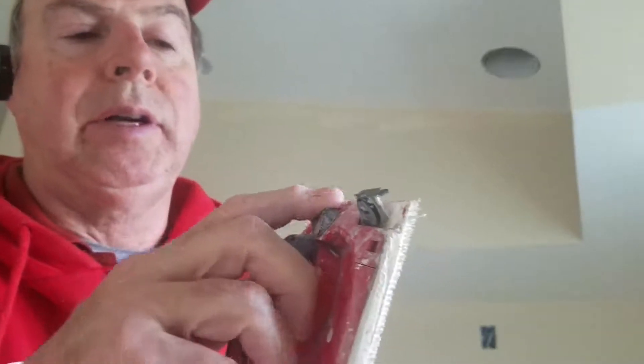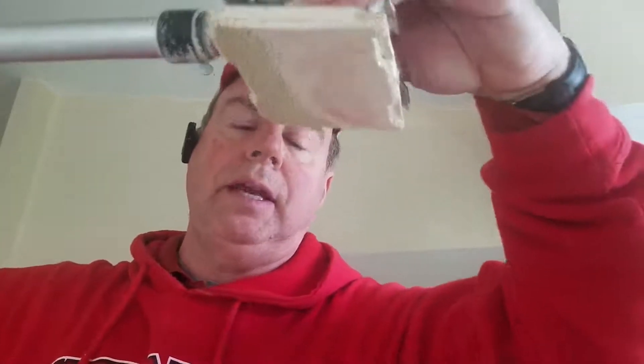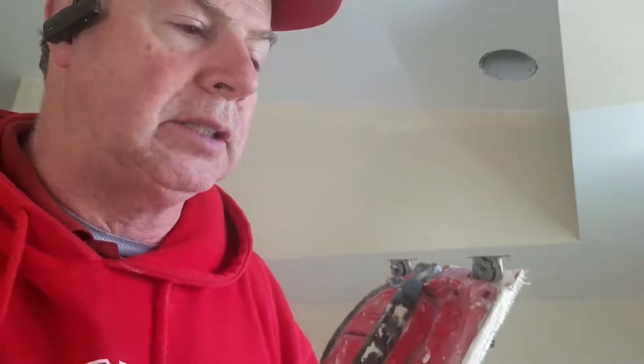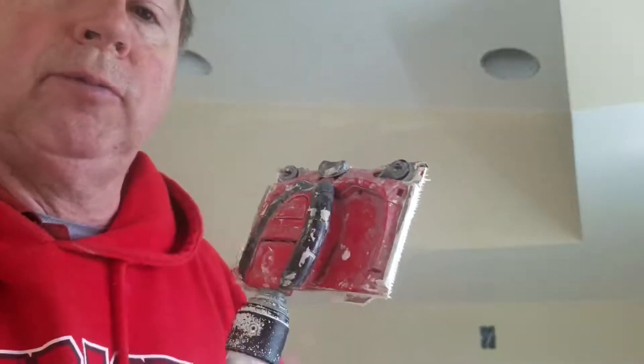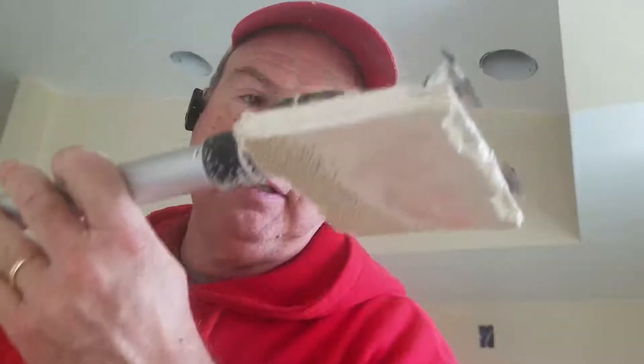I wind up pulling the wheels up and out of harm's way when I put paint on this, when I set it down into the pan. The situation is if you go really deep into the surface of the paint, you're going to get paint up on the edges of your pad, and the next thing you know it'll be all over these little wheels that shield you from touching the adjacent surface like the ceiling, and then it'll become a paint delivery system for you. So when you load the pad, pull the wheels up, set it in the paint. Carefully, don't penetrate deep — kind of like a mosquito on a pond.